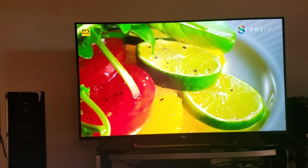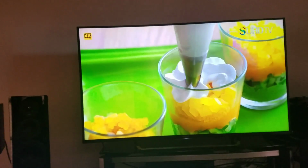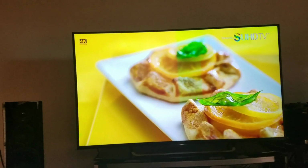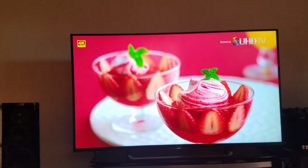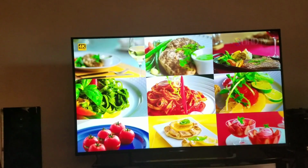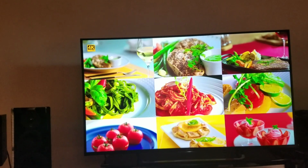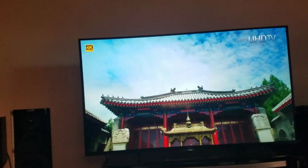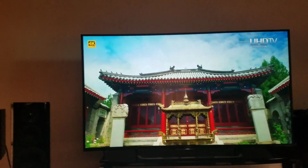And by the way, guys, it is pronounced S/PDIF. So S/PDIF, that's Sony Philips Digital Interconnect Format. That's our optical and digital coax. But it's historically been a popular connection type to get digital audio to soundbars as well as AV receivers. But it supports 2 channels of uncompressed PCM audio or Dolby Digital audio.